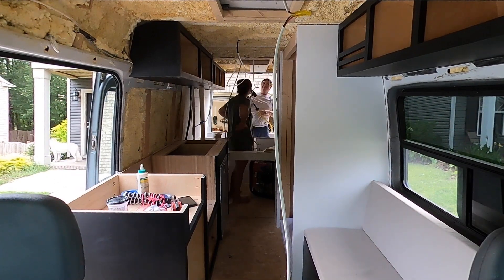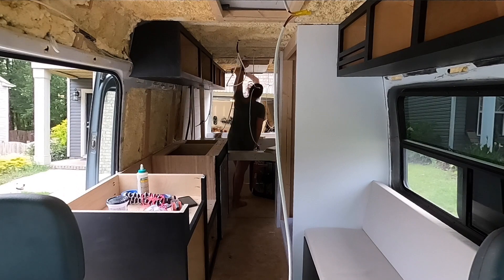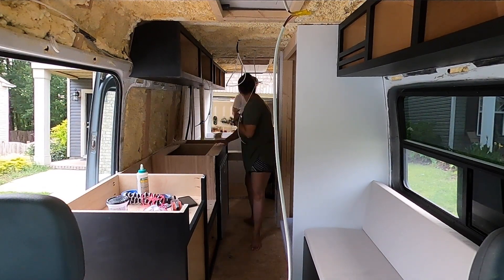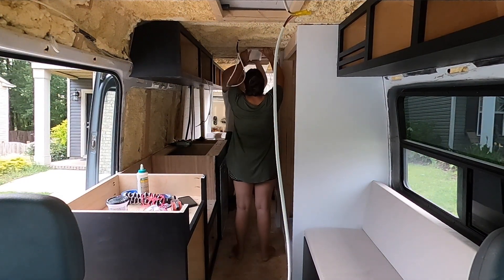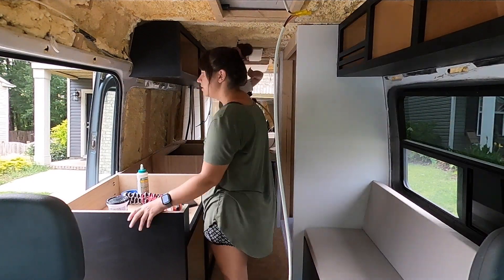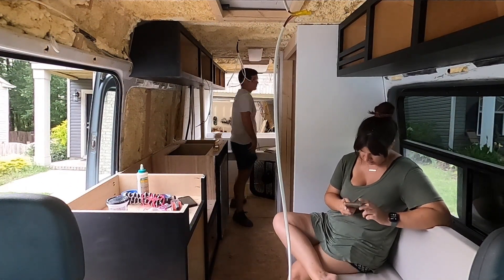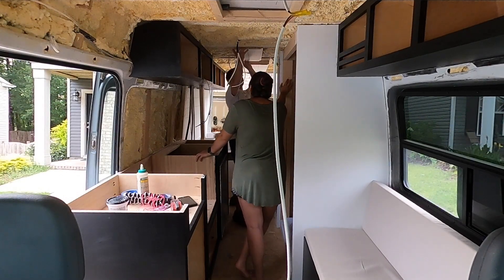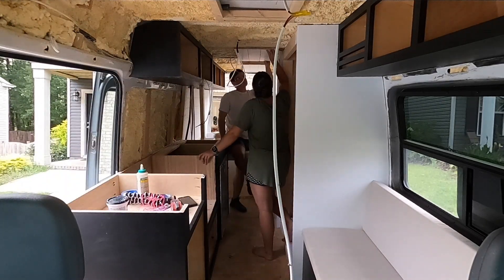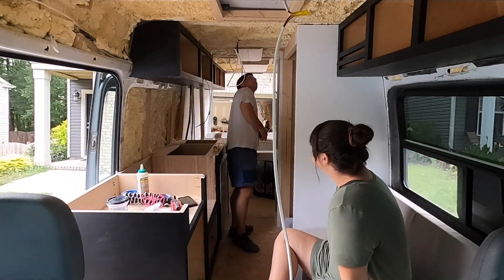We found the middle of that 14-inch AC opening, marked the middle of a piece of shiplap, and lined those two marks up — that's how we got the perfect center piece in. This goes much faster with two people since you have to hold the board on the ceiling and then nail it in. We chose 18-gauge brad nails, which is a pretty common way to install shiplap. Initially we were going to use cedar tongue and groove and stain the ceiling, but we changed our mind once we decided to go with black cabinets and a white ceiling.